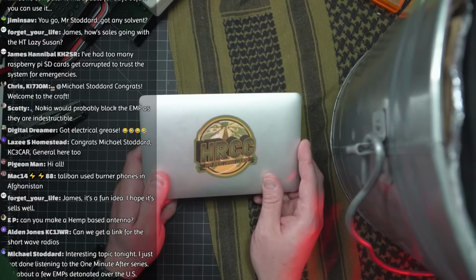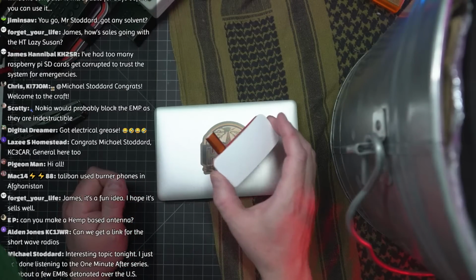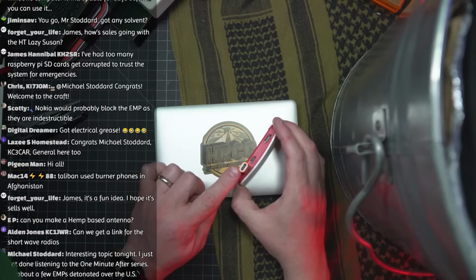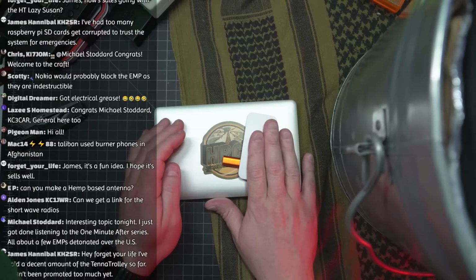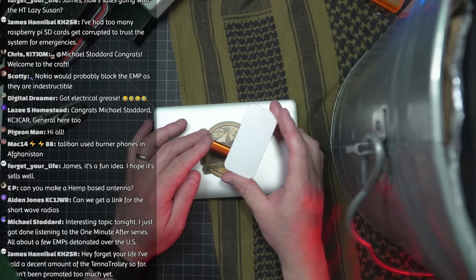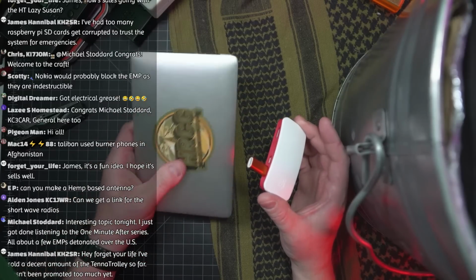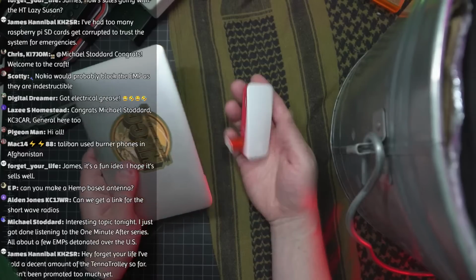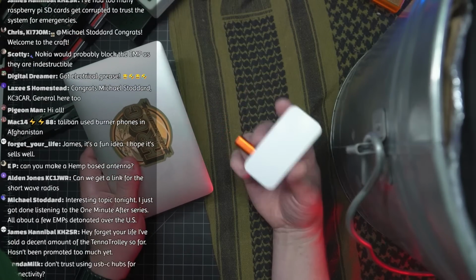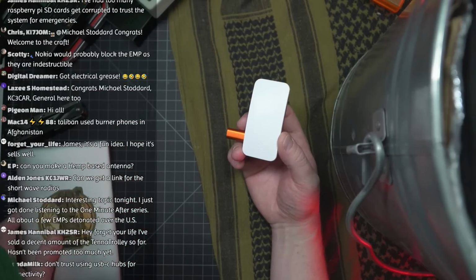With that said, I'll be really clear that if you were going to do digital at night, say you're going to go to sleep, I would rather just run the Raspberry Pi. I would rather plug this into your battery bank, plug that into your radio, and let this run, because this thing is so lightweight on power. It's not fast, but it's way cheaper from a power impact than running a laptop. So the Pi Zero, the W version, whatever the fastest W version that came out, low power, higher speed, that's what you want, from my point of view. So FYI.